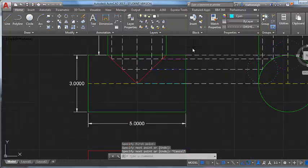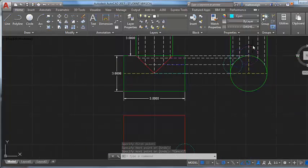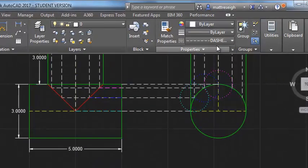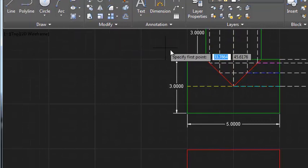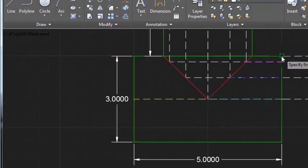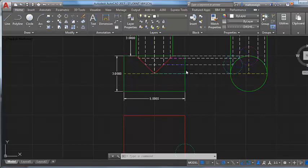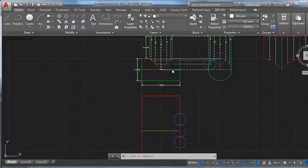Awesome. The only thing I really haven't defined is where I started, the center point of that magenta colored circle. I'll just call it white. So all I really need to do is pick up a white line that is the very top of my pattern here to where the branch starts, because it's just the way I've divided my circle. There ends up being these 4 lines of information that tell me from the end of a header over to where the branch pattern starts, or these lengths are associated with it.